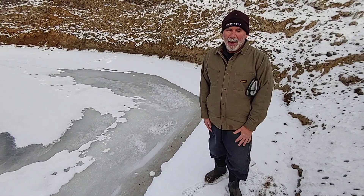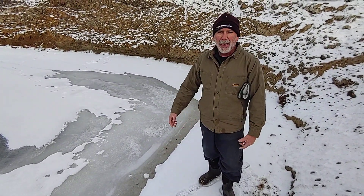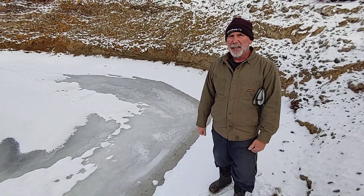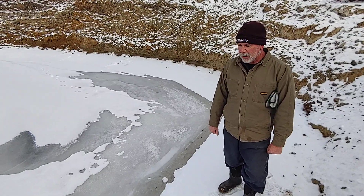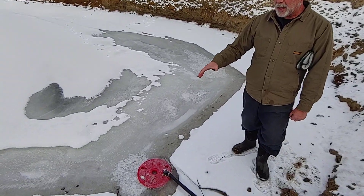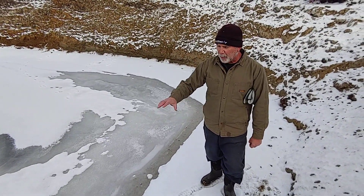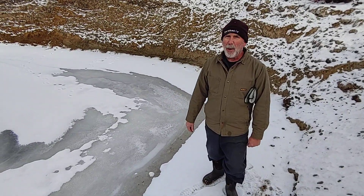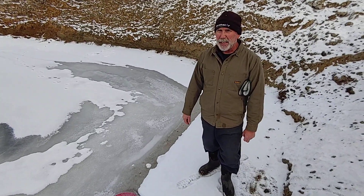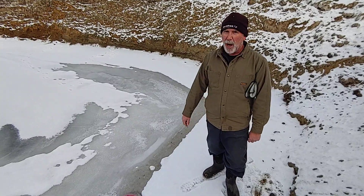It's a lucky thing that worked out because the water level is dropping, leaving a gap. If the water level wasn't dropping and was right up at the bottom of the ice, a lot of people put an old piece of carpet or an old coat over top of the hole to insulate it — that will help. It will help on decent days like today around freezing, but if it got down to minus 20 or minus 30 it will still help, though it won't stop the problem of freezing entirely.